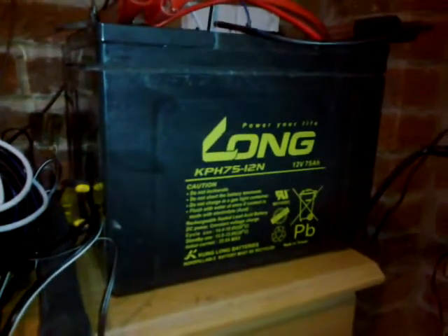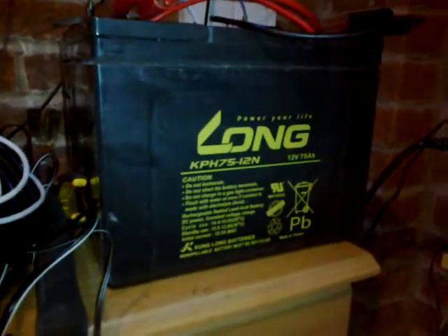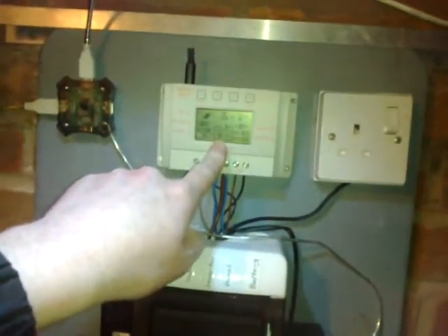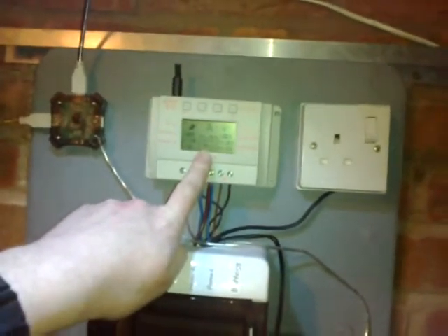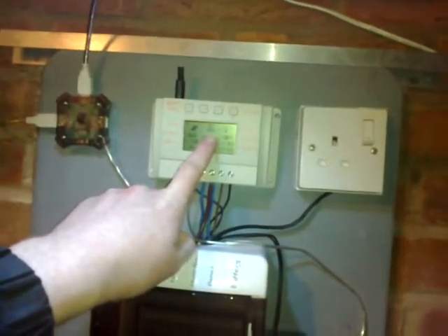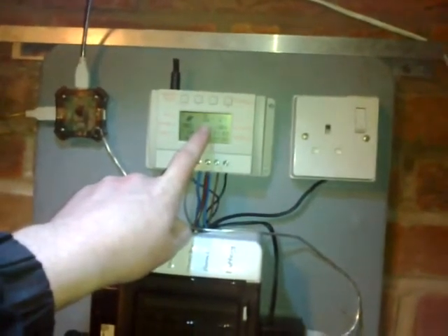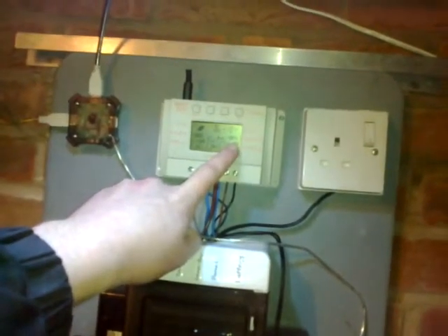I should have really charged the flat one up and then put them together, but they're both showing 12 volts — one was just slightly lower in amperage, so they'll try to level themselves out. At the moment it's saying the battery is 70% full at 12.6 volts. I checked them both on the multimeter before I wired them up and it said 12.7 volts. I'm drawing 0.4 amps at the moment with the radio on scan.